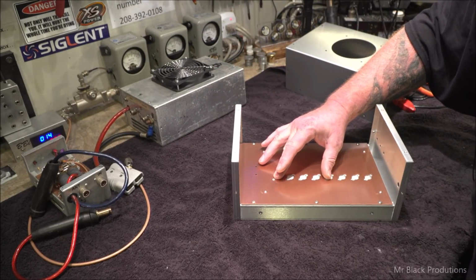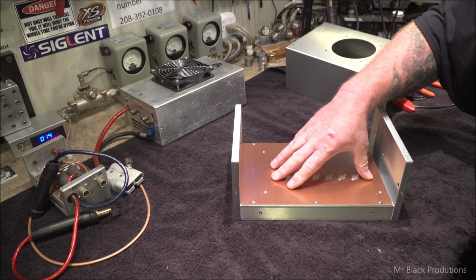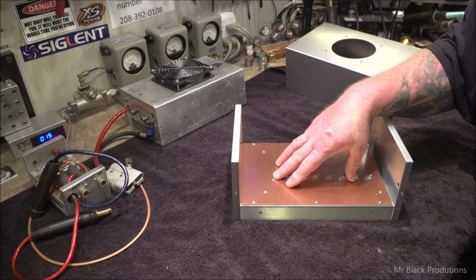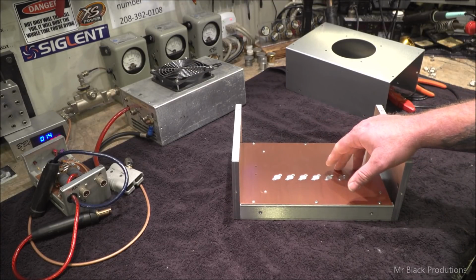So we're going to graft the 4-pill section out of this thing. We're going to stick it down here, and then we're going to put the 2-pill section up here in the front. So let's see, I think 1, 2, 3, 4. Yeah, it's an 8-pill. So we're going to give it a little bit more heat sink. We're going to put a big old gnarly fan on it that makes a ton of noise and moves a good bajillion watts of air. And watts of air is right. Not lots, watts. Put 2 coax connectors on it, no relay. You're going to get a big old ground distribution bus. We're going to see what we can get this to do for power.